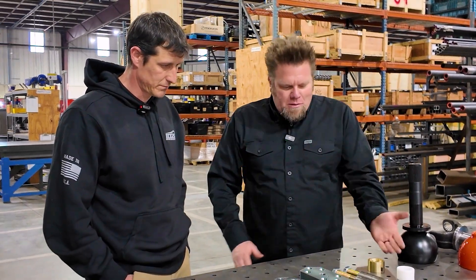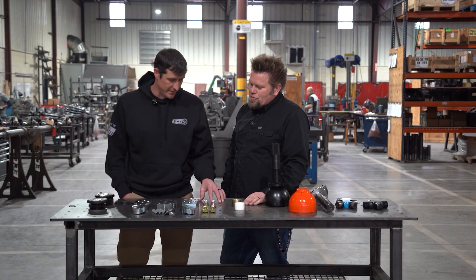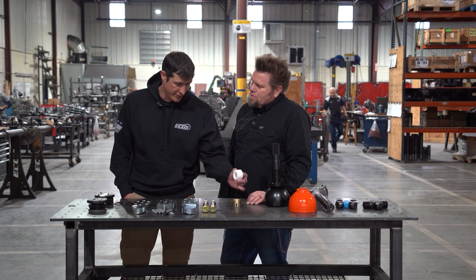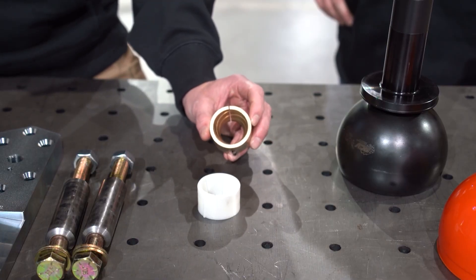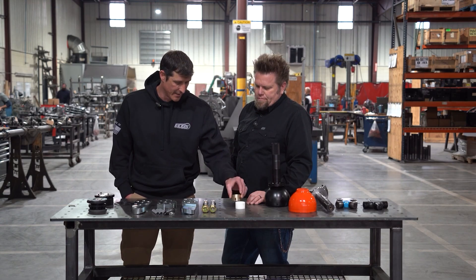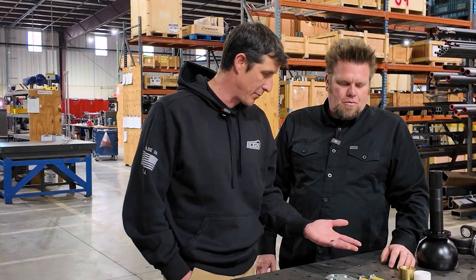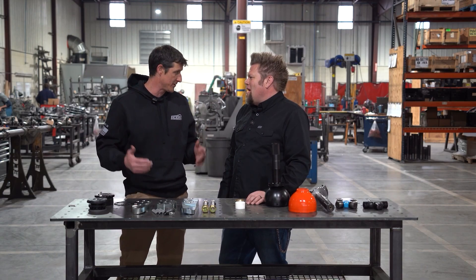Now we've got one simple upgrade: kingpin plastic versus bronze bushings. Kingpin 60 — same bushings — people have had issues with these splitting or loosening up. A popular upgrade: Reed originally came up with this idea, and we run Reed ones if somebody requests it. It's just a little bit harder. I personally like the plastic bushing — it gives some cushioning in the instance of a shock load. And if you split that plastic bushing, it costs like $4. It's easy, and it's right underneath the high steer.